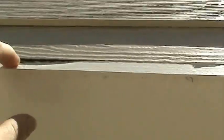On the right front of the garage — and this kills me — he had the house repainted but they didn't mention the flashing. You can see where the flashing is here; it never sealed the bottom edge and it overlaps, catching water. Right here it's rotted through — I can put my finger through it. Over here, the flashing is non-existent. So this top of the garage really needs to be re-flashed and have this 1x6 replaced. The flashing should extend three-quarters of an inch to an inch and a half beyond the outside edge of the trim. It's really crucial on windows but even more so on garage doors, because there's usually a break in this slab and the moisture that gets behind here with Hardie plank siding is dry-rotting the framing. More importantly, the moisture draws termites. We see a lot of termite damage in garage areas because of flashing and caulking issues like this one.